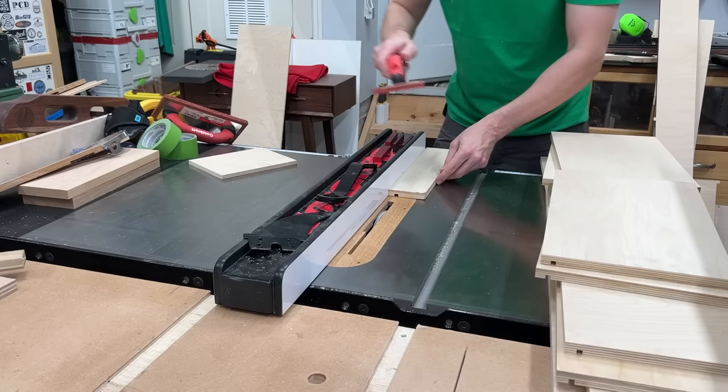With all that sorted out, I could get to hand brushing the face frame. I used a foam brush and a bristle brush — no issues whatsoever with the semi-gloss here. I ended up putting three coats on, trouble free. While that was drying, back at the shop I could drill the holes for the hardware in the smaller drawer fronts — these just get brass knobs.